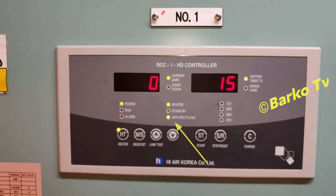The anti-recycling has a 30 to 45 minute delay before you can restart the system. After 45 minutes the anti-recycling clears and you can start. The system is already pumped down. For example, if you need to change the oil, you pump down — close all isolation valves, all refrigerant is already in the receiver — then you can proceed with your maintenance.